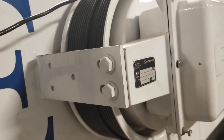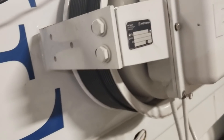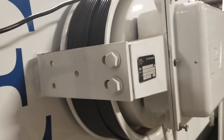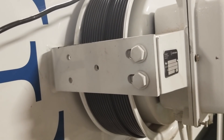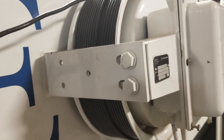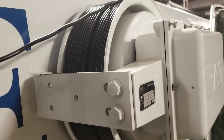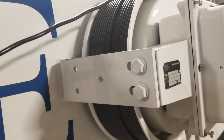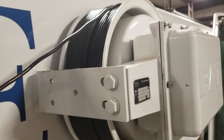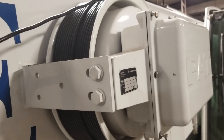This is a multi-purpose, multi-function cable. There's a series of conductors inside it — that transfers the signal for the anti-two-block out at the tip. It also transfers data for an anemometer, lights on the end of the boom, and even an aviation strobe if you had one on the end of the boom for working around airports. All of that is handled through this cable. The other function is that as the boom telescopes in or out, it measures the length of the boom and tells the computer how much stick is ran out.